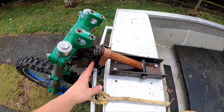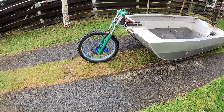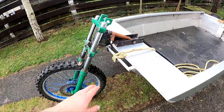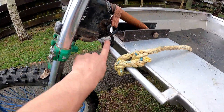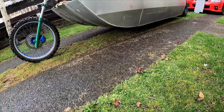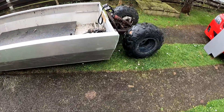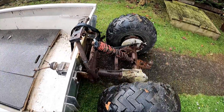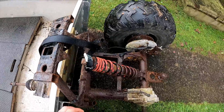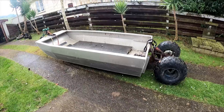I've just got this dodged up for the meantime, just sort of tacked together. The front's almost at the right height already, even though it can swing down a little bit further. The back's a bit too low, but it's just a matter of changing the shock position. I've got to make a swinging mount for the shock so it can raise and lower. I think this is going to work.